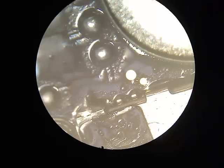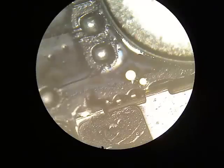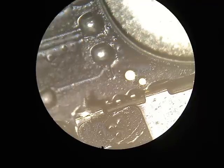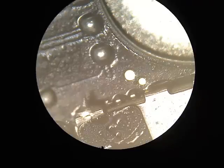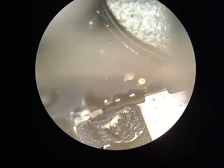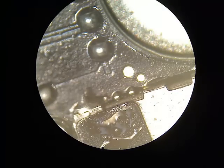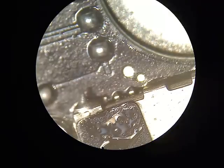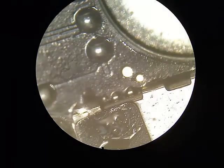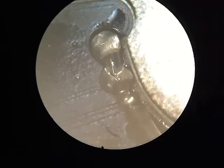Okay, so now you're ready. The next step is putting flux onto the connections that you want to solder — put lots of flux on it — and put the battery connector on top. Then you heat it up with a hot air gun. Since the solder melts at 138 degrees Celsius, you can set your hot air gun to 200 or 250 degrees Celsius. I prefer to go up to 300 degrees Celsius for this repair, because the 200–250°C I'm describing is really the on-board temperature, not the temperature set on your hot air gun.